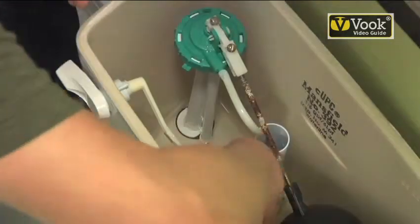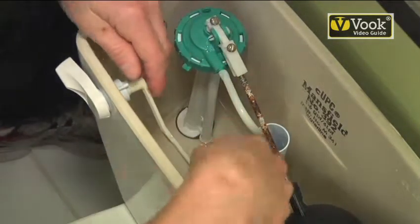Take the other side, put it on the ear like that, and now your flapper valve is going to sit correctly on the drain from the toilet tank. This is your chain for adjusting how much movement is in your flapper valve.